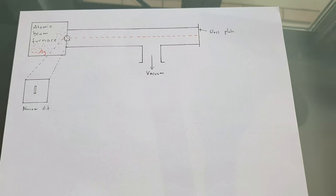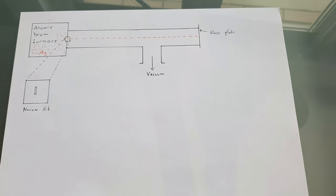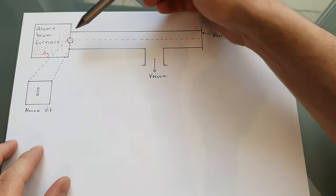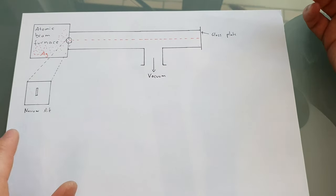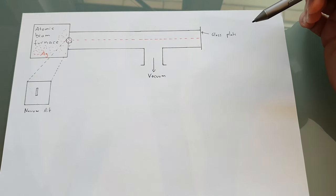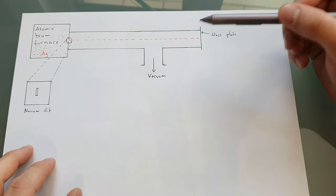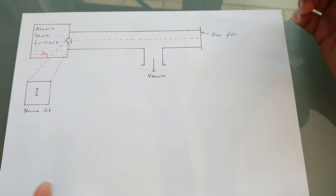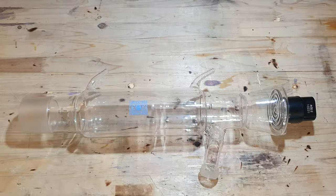This experiment showed that even a system at an atomic scale shows quantum properties, and it showed that the spin of electrons is not random but quantized, which means it can have only two values. The setup of the experiment consisted of a tube that was under high vacuum. The pressure was around 1.3 times 10 to the power of minus 5 millibars or 0.0013 Pascal. This was achieved by a roughing pump and two diffusion pumps. In keeping with the style of the time, these were of course filled with mercury.